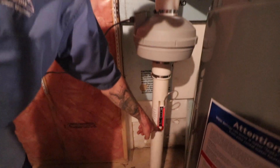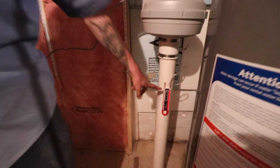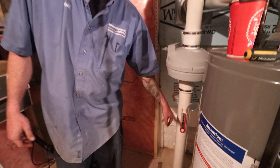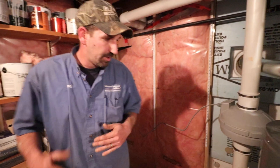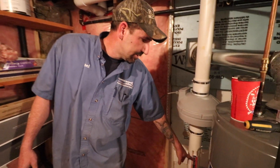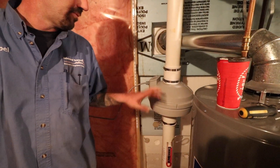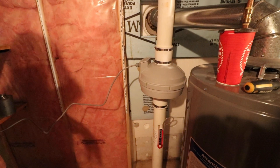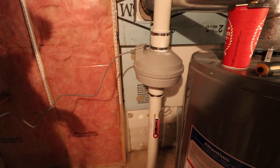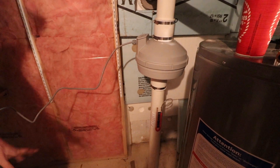See how that tube pulled all the way up? For every motor I have a different number — a gauge that tells me where I've got to be. This one I need to be over about 3 points, anywhere from 3 to 4; 3.75 is usually what these run at. Because I'm pulling directly off soil, I'm not actually tied into any drain tile or sump.